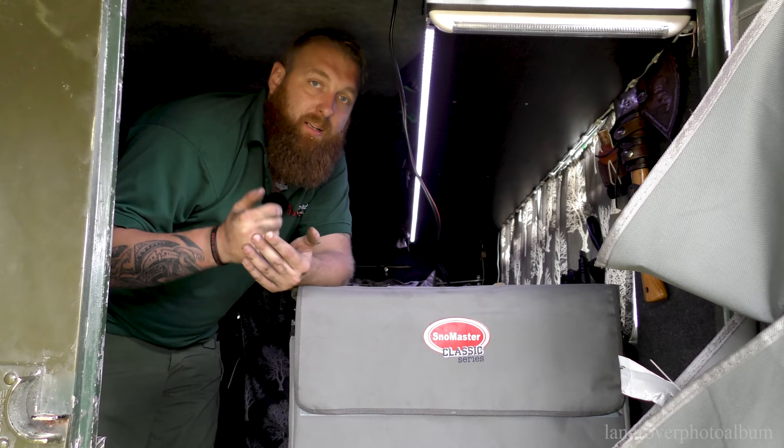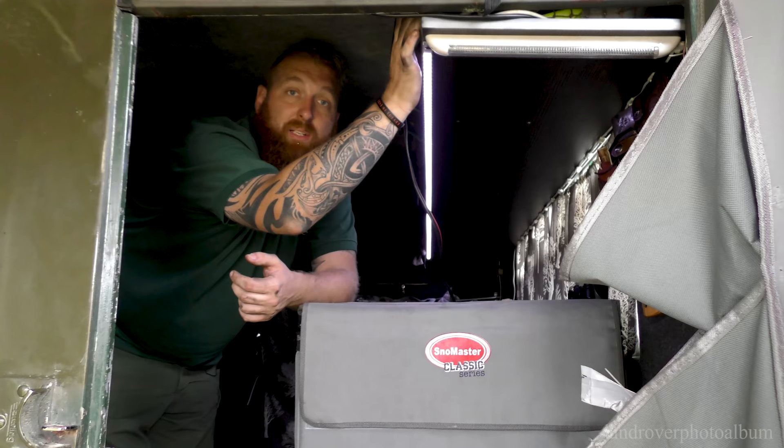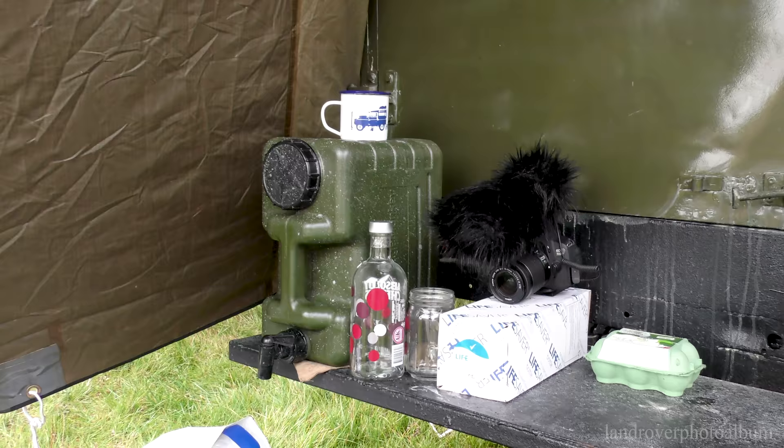It's a large battery bank in the rear which feeds multiple marine switch panels with fuses in. Really, really easy to do — just run a cable to it. There's a fuse at the far end for the panel itself, and all these switches are individually fused. So if there's any issues you just go to that local point and sort it. Very, very easy, and it's all cheap and easy to do.